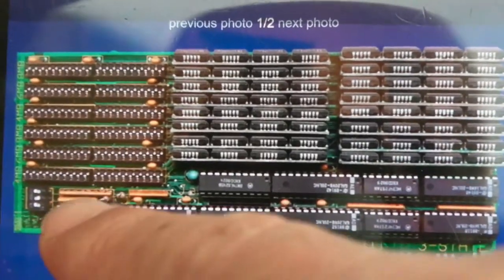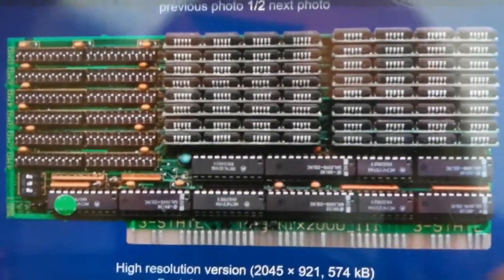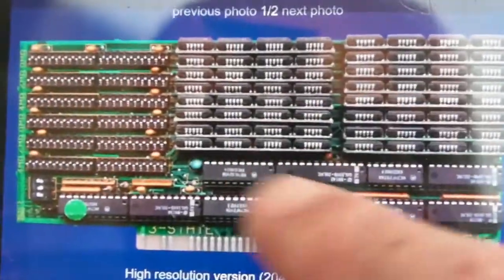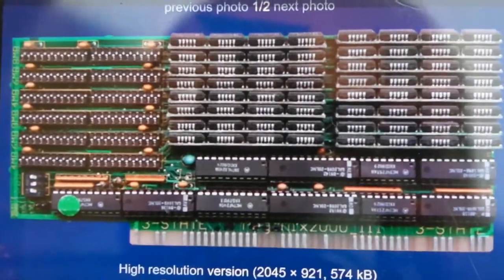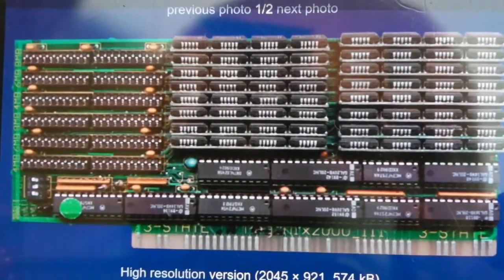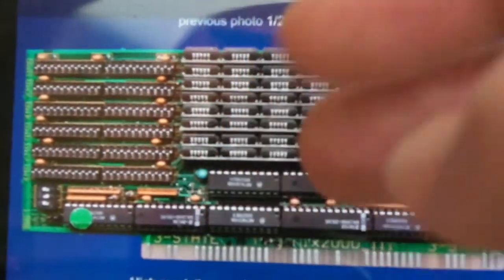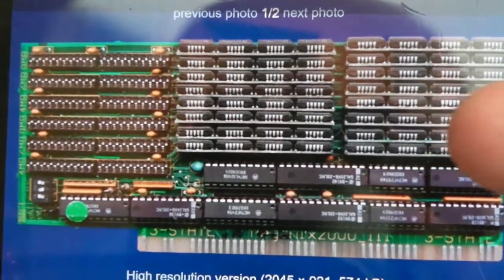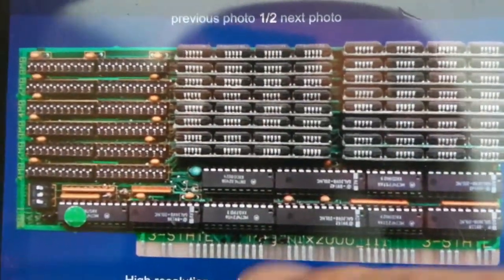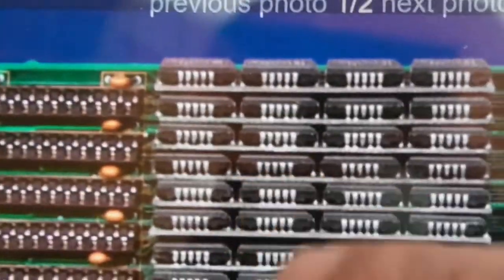He exhausted all options here, swapped all these chips around, reseated them all, swapped the buffers, swapped the, I don't know, the 253s or 157s or whatever they were. The behaviour never seemed to change. You always got a number of different bits showing up as an issue. You would swap the chips here different ways around, and the pattern that came back was the same, regardless of the fact you've moved them all around. So there was something wrong, I think, with one of these GALs on here. The traces and things were all right. I spent hours messing with this, trying to understand what the actual cause was. I think it was just a bad GAL.